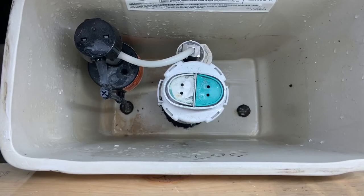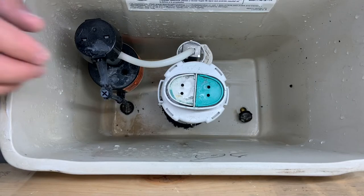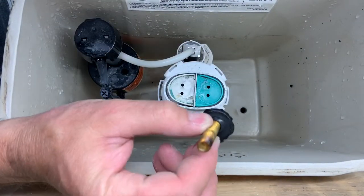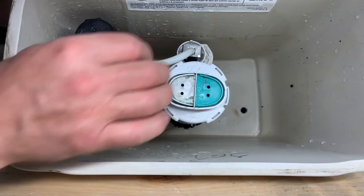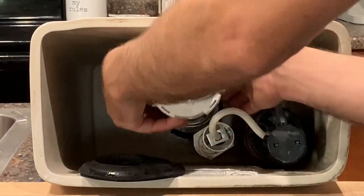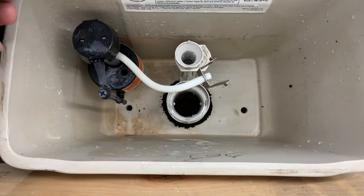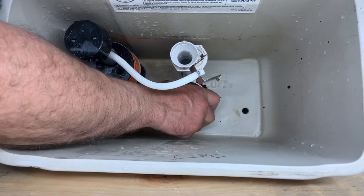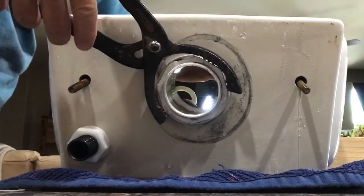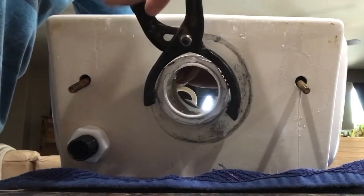I got a couple 2x4s and set the tank on top of those in an easy position where I could get to both the inside and the bottom of the tank at the same time. If you're going to do the entire flush valve you'll probably need a seal kit to reseal the tank to the bottom part of the toilet. I removed the two bolts, then removed the fill hose that goes into the flush valve from the float by squeezing the clip and pulling it up and out of the flush valve. I removed the top of the flush valve by pressing the two clips holding it to the lower part, then held the bottom part on the inside of the tank while loosening the nut on the bottom side using a universal oil filter wrench — or a pair of channel locks would work as well. And that's all there is to removing the flush valve.